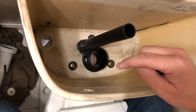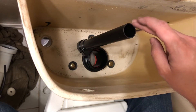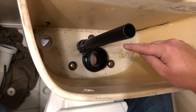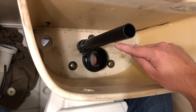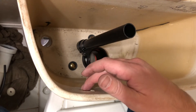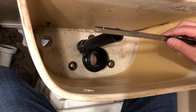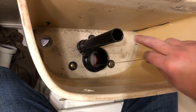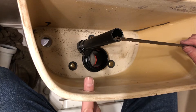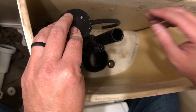The next thing you'll need to do is measure the tank lever hole. Your flush valve needs to be one inch below that hole. Measure the depth of the hole, find where one inch below that would be, and cut the pipe at that point so water won't go out of the flush hole. I used a hacksaw blade — for me it was nine inches — to make sure it was at least one inch lower than the flush hole.